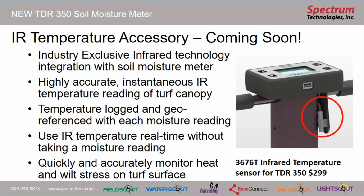The two numbers may not and probably should not ever be exactly the same, so they shouldn't be compared, because they are measuring different things and in different locations. That's just important to note. The beauty, in my opinion, of this IR temperature accessory is that the thermistor does take a few moments to come into equilibrium with the surface in order to give you the most accurate reading, while the infrared is instantaneous. So as fast as you can press that read button, you can get fast, accurate readings with the IR sensor.